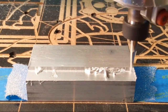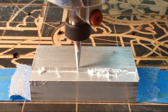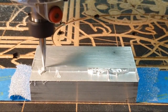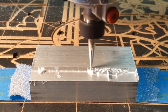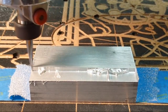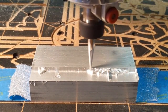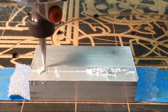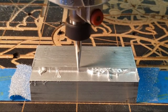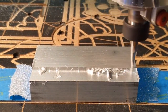Yeah, so this is for the R17. I really got it. Yeah, it's actually the same numbers I use on wood. I'm going to be doing a bit more testing with some of these bits to see if I can get them amped up a bit. If I'm running the same feed rate on aluminum, of course I got a much thinner step over. Tighten the V-wheels any more than normal wood? No. The amount of load on this bit right now is so minimal.